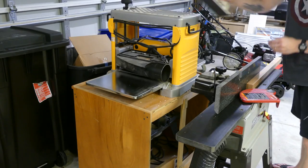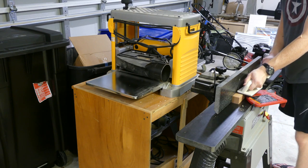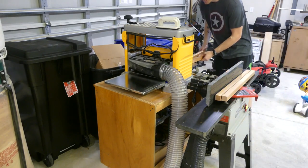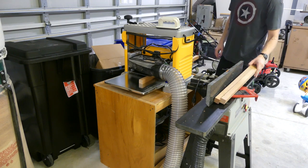After the tabletop was all glued up, I went ahead and took my legs down to final thickness, marked out my mortises, and then started chopping. I did do about half of them with the drill press to see if there was a difference in saving me some time, and there really wasn't, so I'll just keep chopping them.